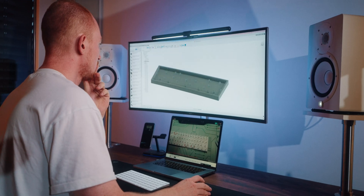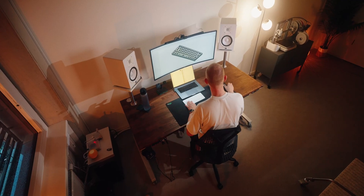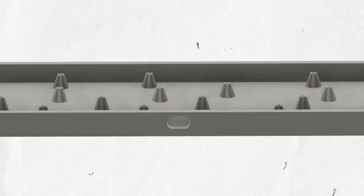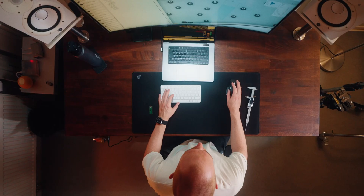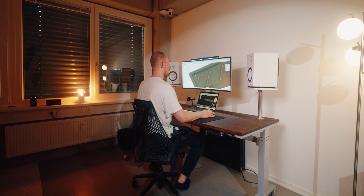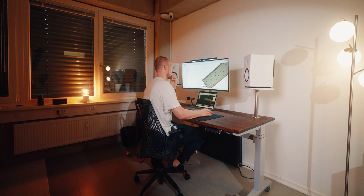Second day. Yesterday I already spent like two hours in Fusion 360 designing all the intricacies. I now have the top plate done and a beginning of the keyboard base plate. I have to make the standoffs where the top plate rests, and I also need to make an opening for the USB-C connection. Honestly the amount of standoffs I've put in there is a little absurd — I might have overdone it — but I'd rather be too supported than have the top plate wiggle and bend. Everything's ready and I'm going to throw it on the printer now.